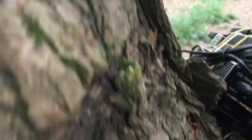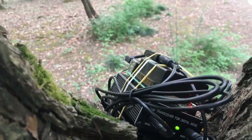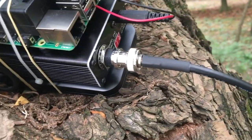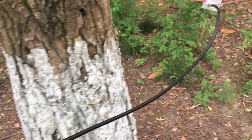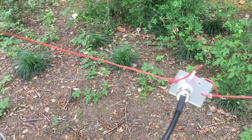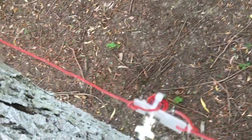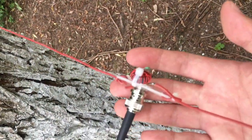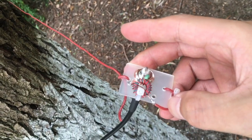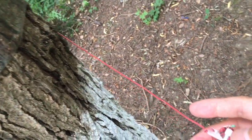This is very tiny stuff, and I put it in a tree — it looks very weird because some people said you cannot pass the security check. It's connected by a BNC cable, and a coax cable connects to the end-fed half-wave antenna that I built myself. I wound the toroid myself — it's a very simple one: a capacitor, some toroid windings, and a BNC connector. This is dedicated for 20 meters, and the cable is about 10 meters.